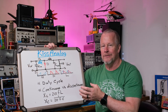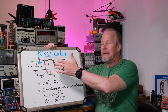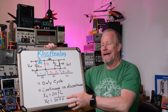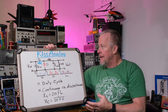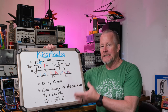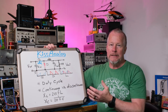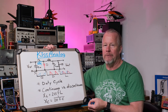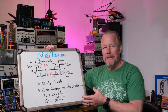You could put a resistor there — it would slowly charge the cap and the cap would discharge into the load, so the ripple is not quite as bad, but then you get huge dissipation through the resistor, so that's not something you want. So you put in an inductor instead — it does the same thing, blocks the voltage and charges up the capacitor more slowly, but the inductor is like the capacitor: it stores energy. It's a reactive component, not a dissipative component like a resistor.